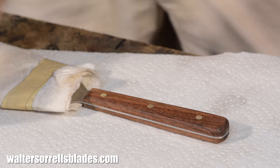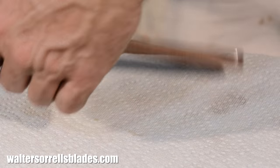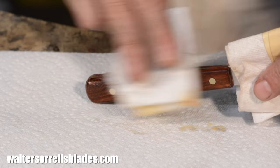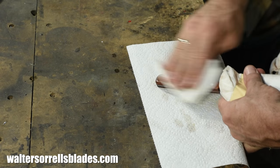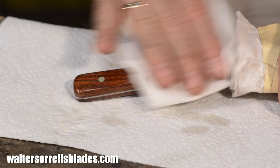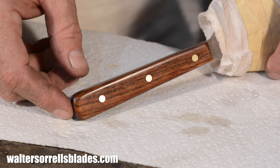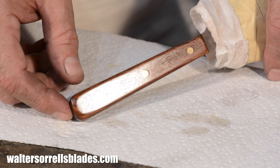So, giving a great polish is as simple as using a basic commercial furniture wax. Letting it sit for a few minutes according to the instructions and then buffing it out by hand with a paper towel. No lacquer, no varnish, no polyurethane, nothing — just wax. That's it. A power buffer is an option, but frankly it's not necessary with a beautiful wood like this. You can do it with a cheap paper towel if you want.